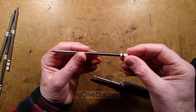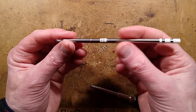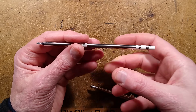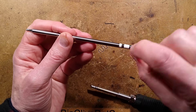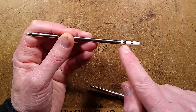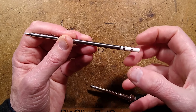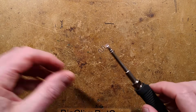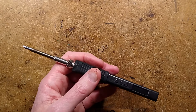It's worth mentioning these soldering bits have an outer metal barrel, which should not really be electrically connected to anything other than mains ground — just for a grounded tip. Then you've got these two connections here, which are not just used to power the element. I believe they're also used for temperature sensing based on the change of resistance of the element according to the temperature it's at.